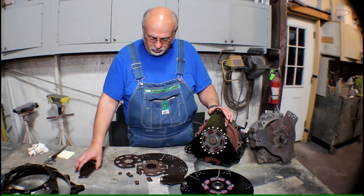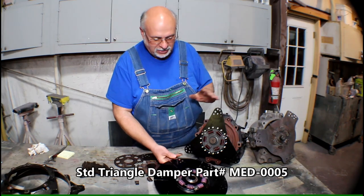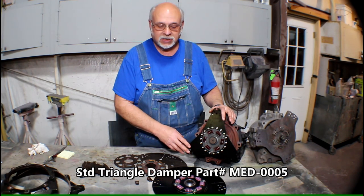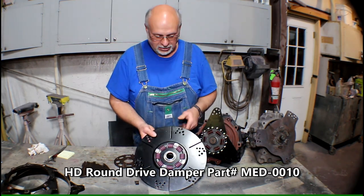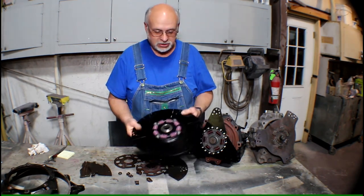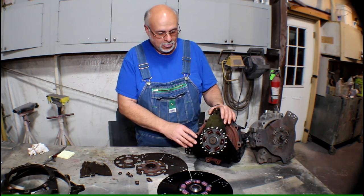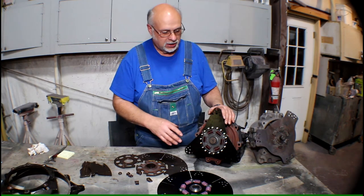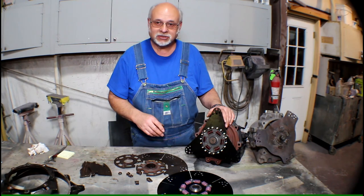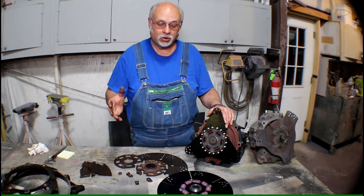There are a lot of these out in the water. One of the dampers that we sell — now the difference between the triangular and the round one: if you go by the books, the triangular one is typically used for small blocks, and the round one is typically used for big blocks. However, starting in the late nineties as small-block Chevys got more and more powerful, some boat builders started using the heavier-duty round dampener. What I recommend: if you've got a small-block Ford or Chevrolet in the 270-horsepower-or-below range, the triangular dampener works just fine. But if you've got a small block — mostly fuel-injected small-block Chevys — in that 300, 315, 320, 325, 340-horsepower range, you better be using the bigger dampener.